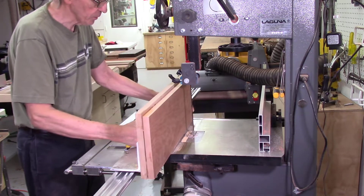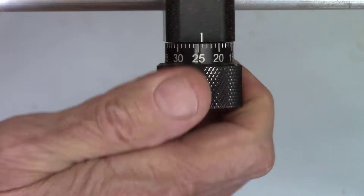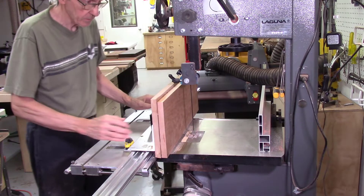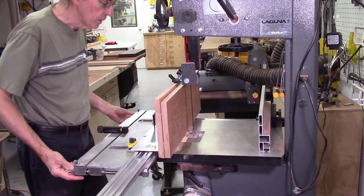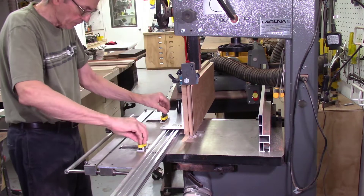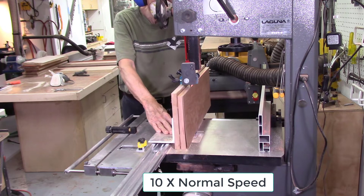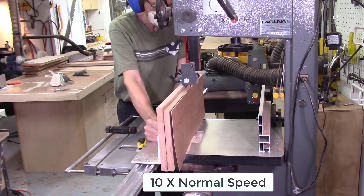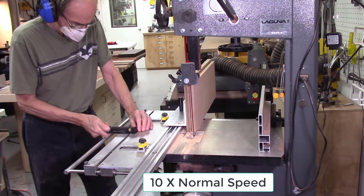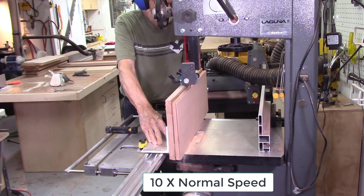On this board, it's just a little bit longer than the table and it sits on there really nicely. I set my gauge to zero. I cut off this first slice as scrap wood — about 20 thousandths of an inch thick — just to give me a perfectly flat surface so all subsequent cuts will be perfectly parallel to this surface. After this first cut, I sliced two panels, each 125 thousandths of an inch thick, for the guitar back panels.